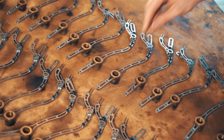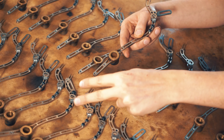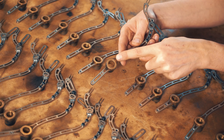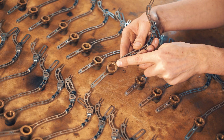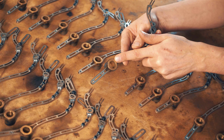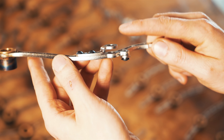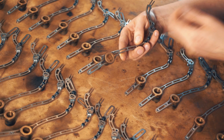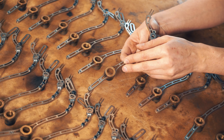These are the pivot arms that are going to release the marbles. There's going to be an extension here that goes down to where the marble is released, and this is the pivot point. This is a brass bushing. I'm very big on ball bearings because I understand them, but it was inevitable for the Marble Machine X project to move further to the land of machinists — the holy glory land of machinists — where everything looks like this, and insert some bushings into the design. These are only going to pivot very, very little, so bushings is the obvious choice.